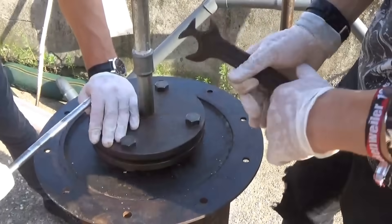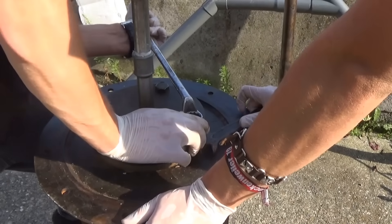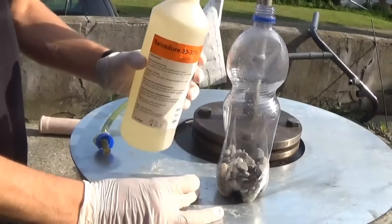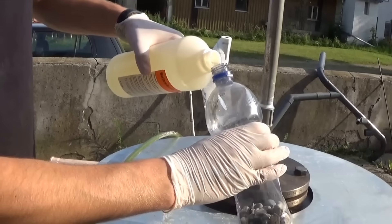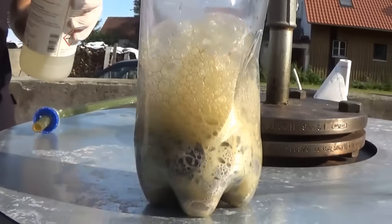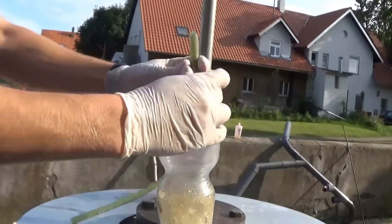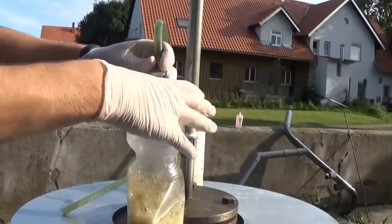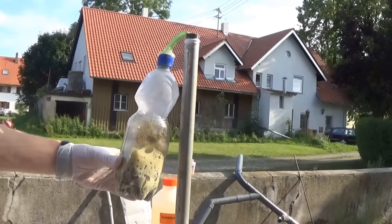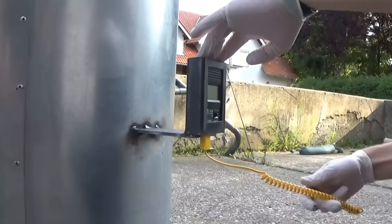Back to our setup — we tighten the screws quite firmly to ensure the seal is tight. Now for the part where I show you how cheap I am: we need to flush the reaction vessel with carbon dioxide so the heated polymers are not oxidizing. Oxidation would form water and very toxic dioxins. You could buy CO2, which is expensive, or make it from lab-grade carbonates and acid, which is also expensive. Since I have 20 liters of hydrochloric acid obtained as a gift, we use the cheapest form of carbonate — some gravel.